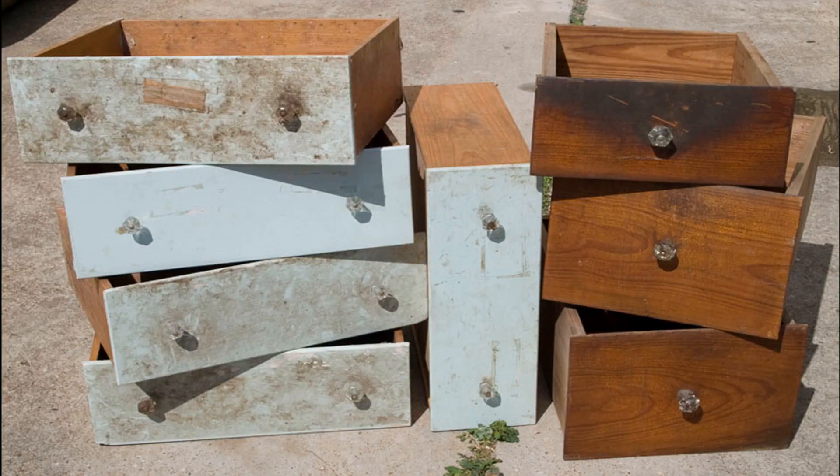If you don't have a big box store near you or a source for good lumber like this, keep your eye out for people getting rid of old pieces of furniture — especially dressers and anything with doors or drawers on it. If you can use the sides or panels from doors, or the sides and bottoms out of old drawers like an old desk drawer, those are very frequently made out of thin, stable, dry, good quality hardwood. They'll definitely give you enough parts to make all the squares you need.